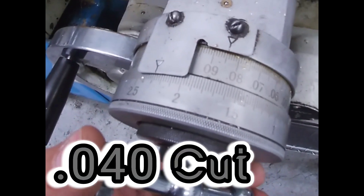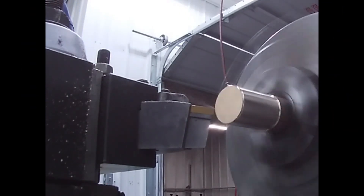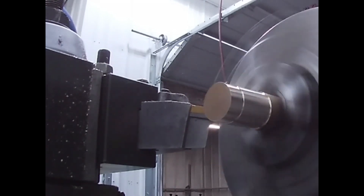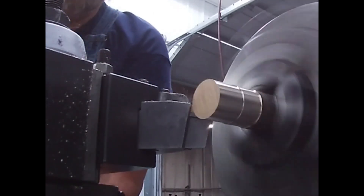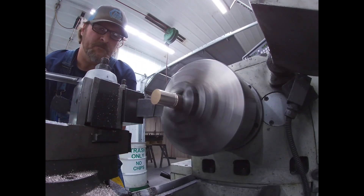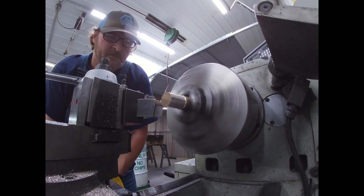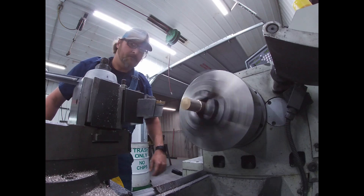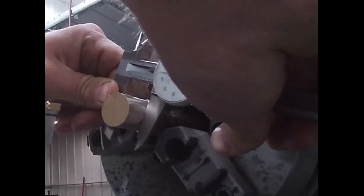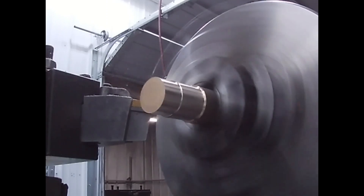You can see on the dial — I'm gonna move it another 40 thousandths and make a cut. This is quite a large cut actually, not really, but larger than the ones I was taking originally. I'm not using the power feed because I haven't been on a lathe in years, so I'm just using the manual handles to do the machining. Let's get another measurement here — I couldn't exactly read that one, I don't remember what the measurement was.